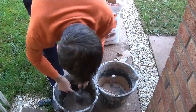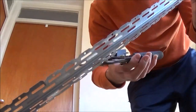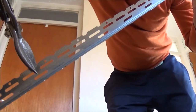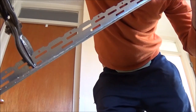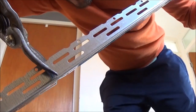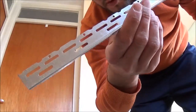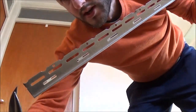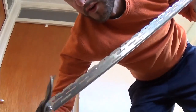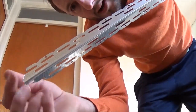As always keep a bucket of clean water handy to give your tools a quick clean before we carry on with the plastering. Let's measure the height we need for the bead and give the bead a trim down to size. I've used a measuring tape and measured this down to size. To cut it, just get your tin snips and cut from the outside in towards the centre, but don't go through the middle hard section. Then do the same on the other side, leaving the middle in place, and just fold it backwards and forwards and it comes off — that simple. What you can also do, which I like to do, is just take off a slight angle — about 45 degrees — and by doing that it stops the ends folding back upwards into your plaster.